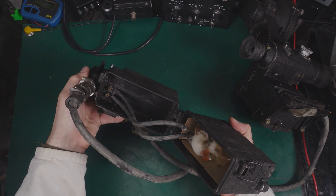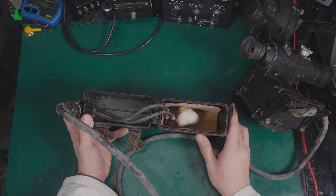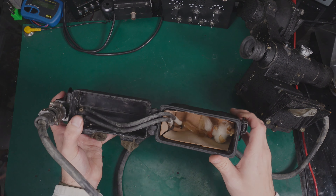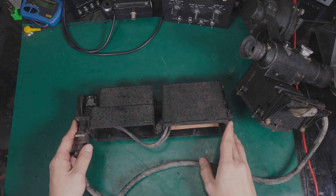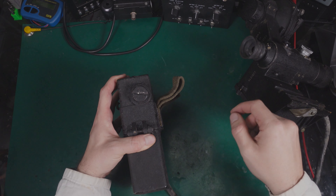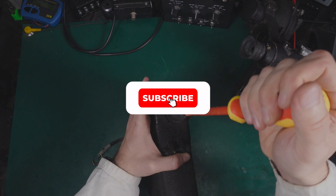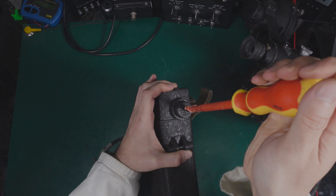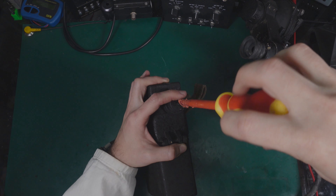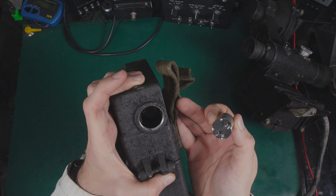When we open this device, we've got a battery holder — we put around 4.8 volts here. This is where it was using wet cells. We've got the battery hooks. In case your device is not working, you can check the consumable element located here — this is a form of a neon lamp. It's used in the power converter for building the high voltage, and when the high voltage is reached it gets discharged. This is how it looks.